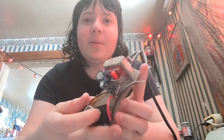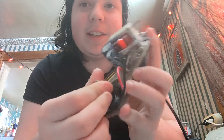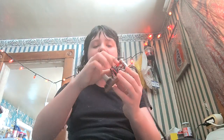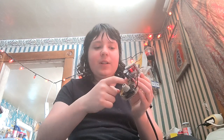I'm thinking of putting some sort of a reset button on this — you touch the button and it shorts it out, kind of like the capacitor kill switch in the LED driver. Basically it does exactly the same thing: it kills the capacitors. We need that because when we switch voltage — say it's on 6 volt mode and we switch it to 12, then switch back down to 6 — it takes a long time to switch back down because the capacitors are already charged to 12. So just a little short circuit button: press that, resets the capacitors, instantly brings it down to 6 volts.